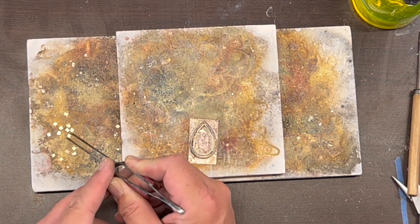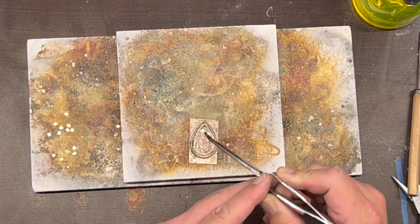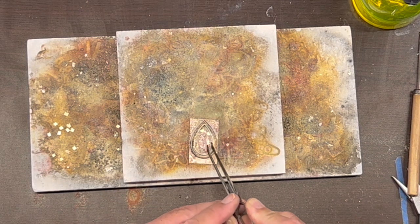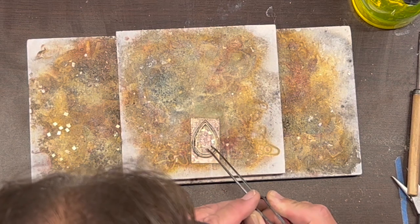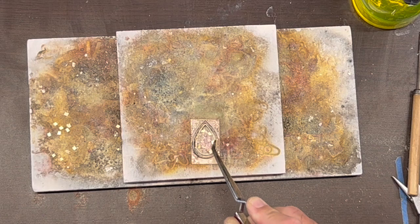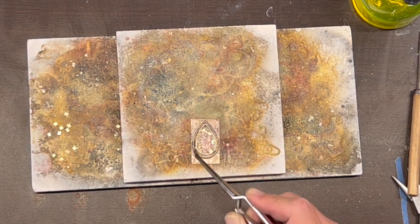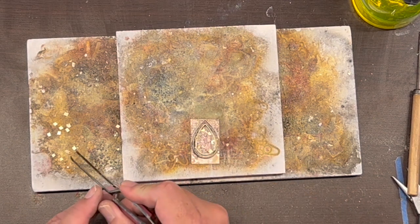I see a lot of people putting pieces about an eighth of this size. They're putting like 16 of them in here, and that to me seems like a lot of excess work, because once it flows, as long as it's touching the bottom and the side, it'll wick along that entire seam, so you don't have to line them up along the whole thing like that.